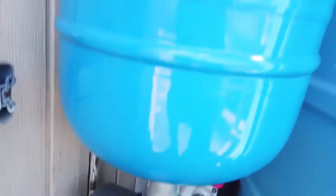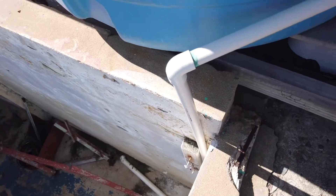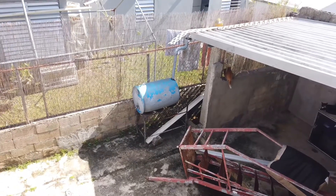It pumps up to the bladder and then goes down these pipes, hits the filters around here, and leads downstairs to where it can feed the entire house. That tank over there is basically just extra emergency water. When we run out up here, Gilbert will get down there, fill the buckets, I'll stay up here and pull the buckets up and pour them into the reservoir.